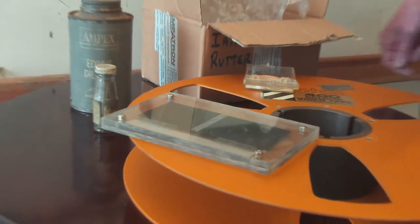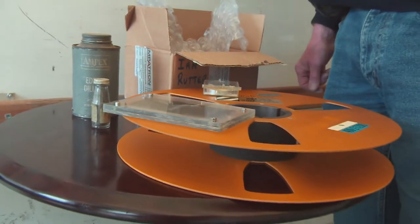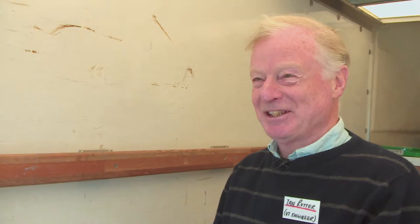Now that did the vision, cut the vision, no problem. You're allowed to cut vision, but you can't cut sound, can you? Because the audience is applauding like crazy, you cannot chop the sound. So you had to edit the sound separately. So before you cut the tape, you dub that sound off onto a quarter-inch tape recorder in sync. You then did your vision edit and chopped the tape.